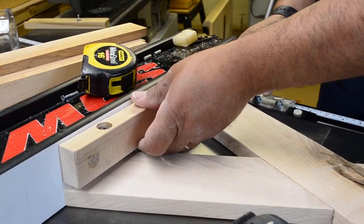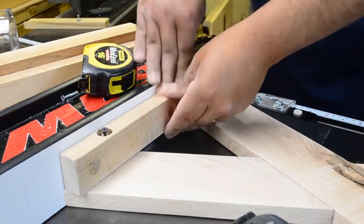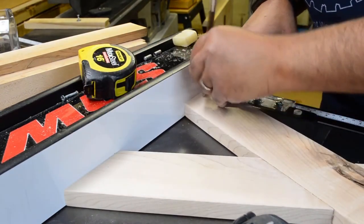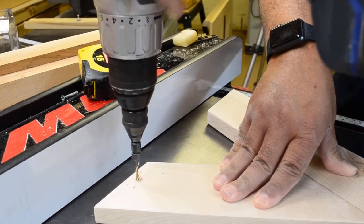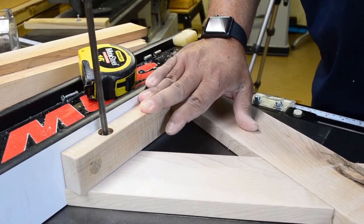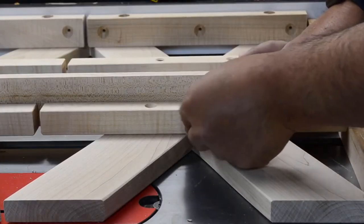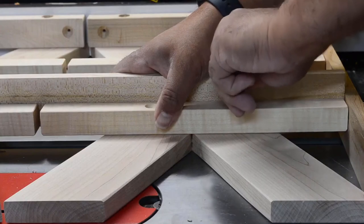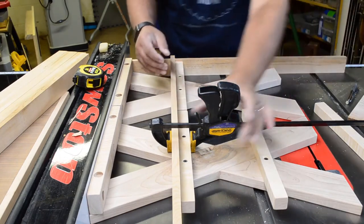With everything dimensioned and preassembled, it's time to start bringing it all together. I already took the time to sand everything and do a dry fit just in case, so really the only thing left to do is to actually assemble it. Using my rip fence as a reference edge for the top support, I line up the location of the top support and press the screws down into the legs so I know where they're going to attach, then mark them and pre-drill the holes to avoid any possible splitting. Then the only thing left to do is to drive the screws home and attach the support in place. One of the easiest ways to ensure the supports on both legs line up as closely as possible is to assemble one leg entirely and then use that as a story stick of sorts for the second one — lining everything up, marking, pre-drilling, and then driving the screws home, repeating for each of the supports.